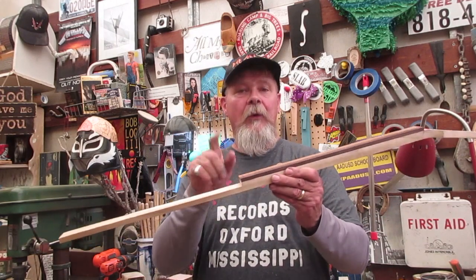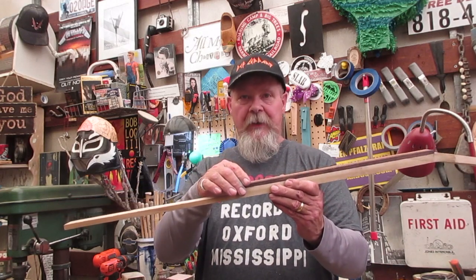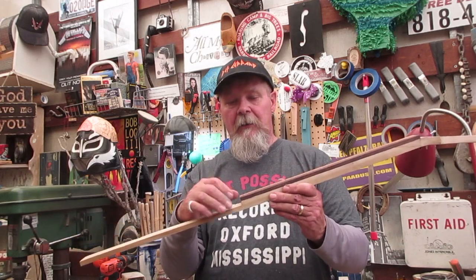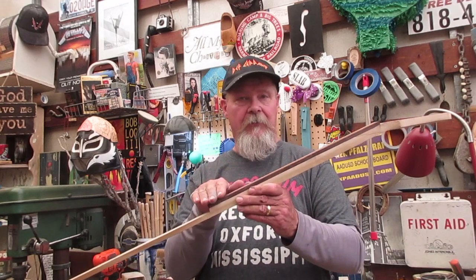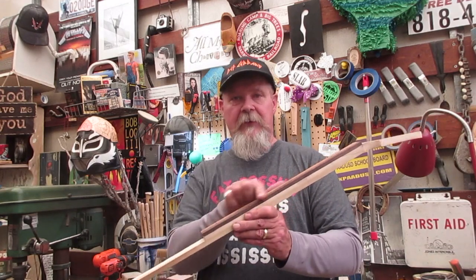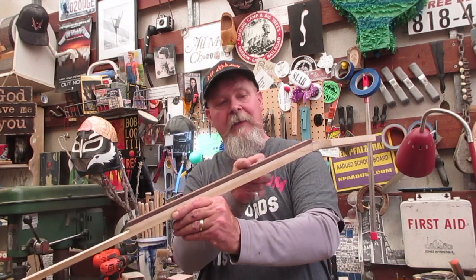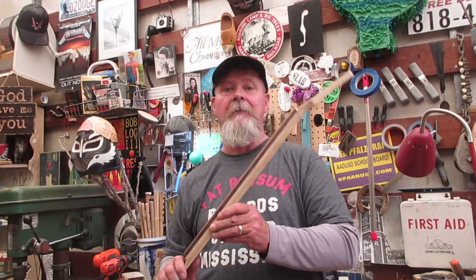Anyway, when you fret a fingerboard, you put the wire in, you tap the end of it, you pick up your fretting cutters, and then you snip it off, and then you do it over and over 20 some times, however many fret slots you have. Now, what if you were able to, instead of pick up, set down, put all that together in a couple of steps, and it speeds up the process? That's what this is all about. So we're gonna have to build some things.